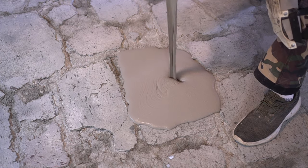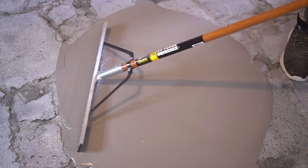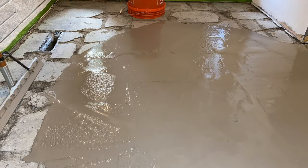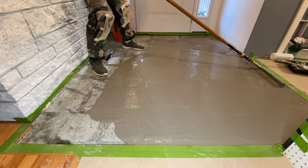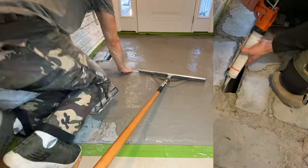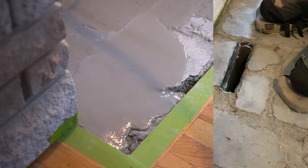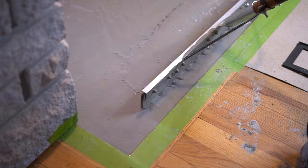I pour the concrete leveler in the very center of the space — the deepest pour since I was a bit overly aggressive with the sledgehammer at first. After pouring, I grab a squeegee and coerce the material into all those small crevices as evenly as possible. The space is approximately seven by six feet and I used about a bag and a half. To prevent the solution from getting into the vent, I applied silicone inside and then foil tape to prop it up slightly higher — a simple solution that completely stopped any material from getting inside.